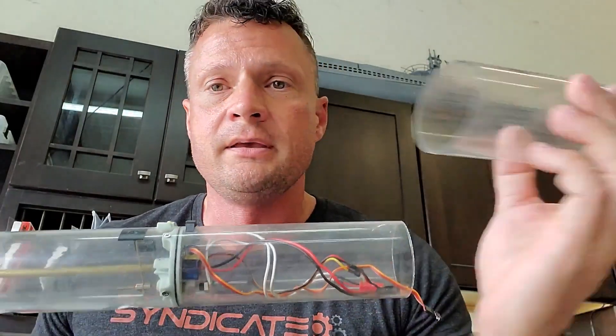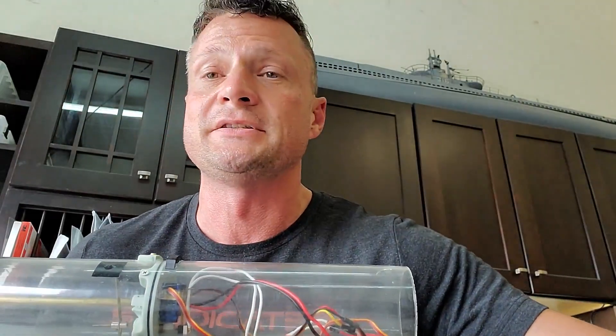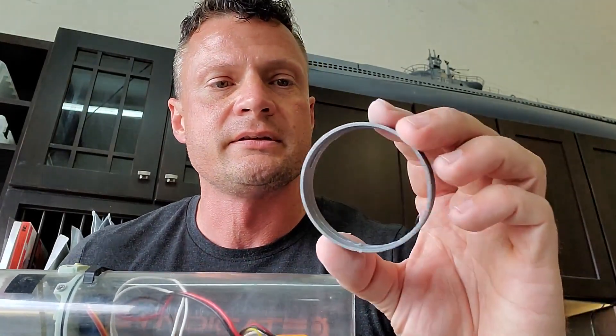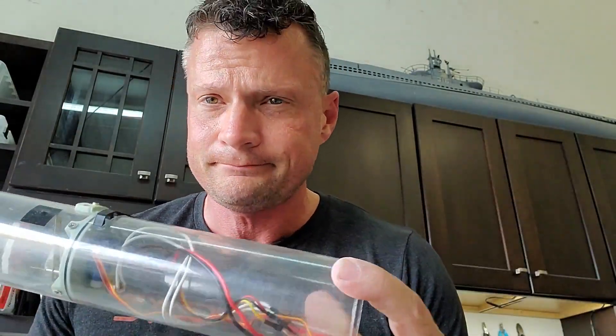What we're going to do is replace this cracked section of cylinder with a new section that I tested and confirmed has perfect tolerance. I'll show you what that looks like a little deeper into the video. To do that, we're going to make a cut and use this little ring that I printed to act as a support ring — it's going to be better than new when we're done.